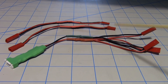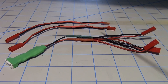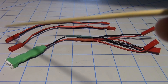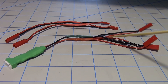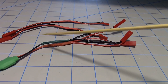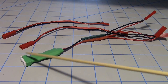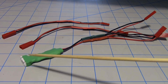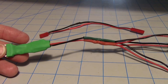The short story is you need three cables like this made up. You can solder up these easily — two JST connectors, a male and female on each end, so you make two like that. Then you make one that has three JST connectors on one end and a balance port plug on the other end. This is for a four-cell battery — you could also use a three-cell — but you'll be picking off 12 volts from whatever battery you use.